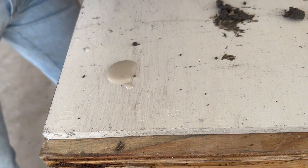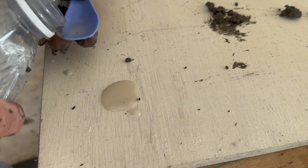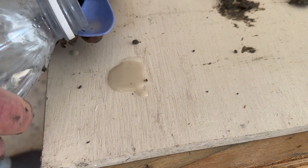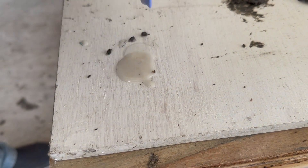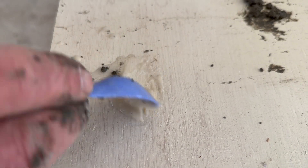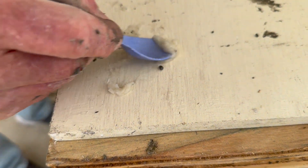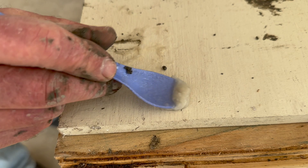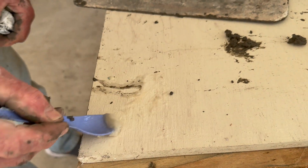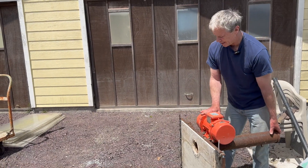I'm putting some 3D admix in and giving it a little bit of water — it's like Elmer's glue. When you mix 3D admix and water, it gels — and you can see it doesn't happen right away, and that's intentional. These are the thickening solids — they react to the presence of water and also more strongly in an alkali or high-pH environment.